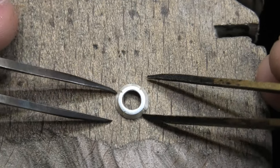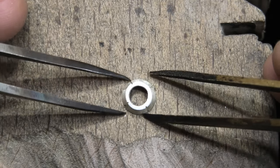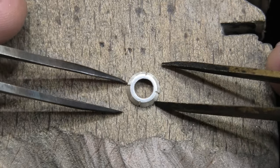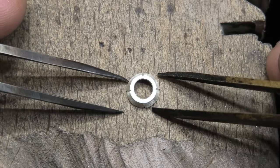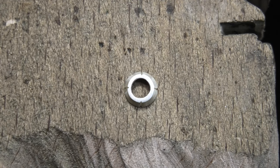What I do is I start them off with a saw cut. What's nice is you can turn it upside down and have a look, check your accuracy, see if you like where your claws are going to go. They do tend to look different - one side might look alright and another way looks kind of wrong. So I rotate it and have a look at all angles, see if it needs improving anywhere.